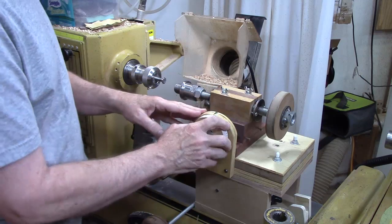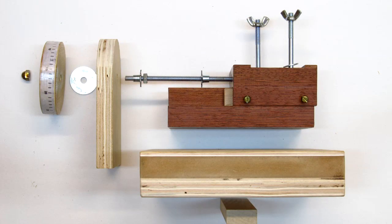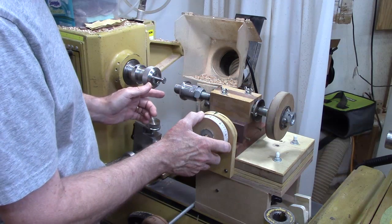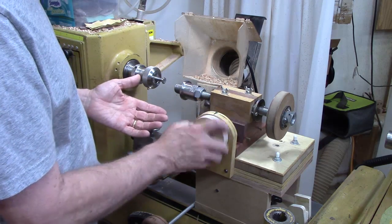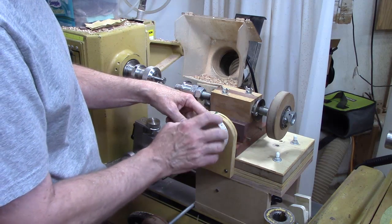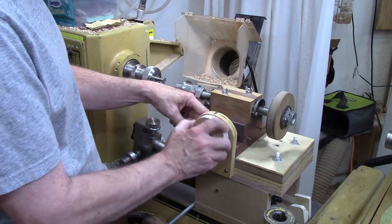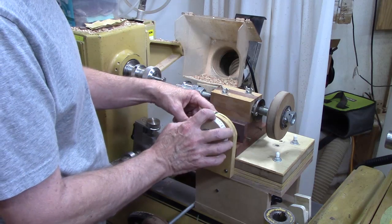The next component is what I call the cross slide vise, and that's the part that moves the jig laterally — it moves the workpiece into the cutter. On a shop-made one, this uses a quarter-inch coarse rod. I put a calibration on it, printed it out in Excel and sized it so it would come out to exactly 50 gradations.